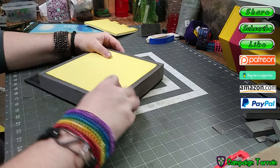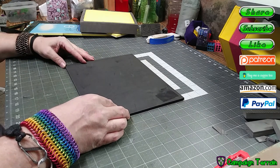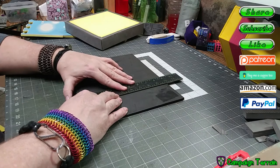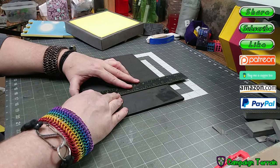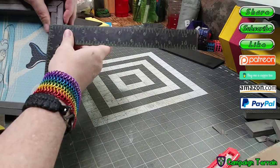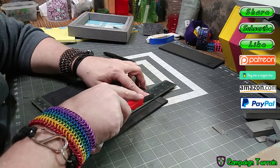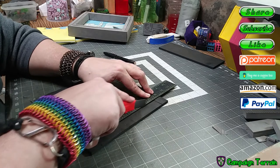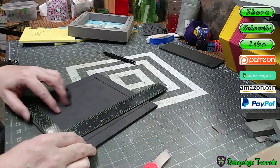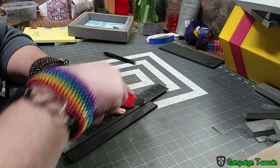I'm going to go ahead and cut a square to match the outside dimension of my box — in this case, nine inches by nine inches. Here I'm measuring the width of my outer wall; mine happens to be seven-eighths of an inch, but your mileage may vary. Now that I've got all four sides measured, I'm going to cut this so it turns out like a big square donut that sits right on top. There's going to be a square piece that drops out of that, which I'm going to use as the cover for the inside bottom of my tray, though you can use anything you want or leave it off entirely.